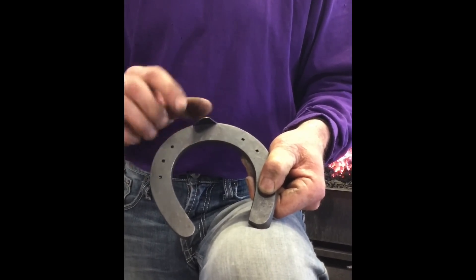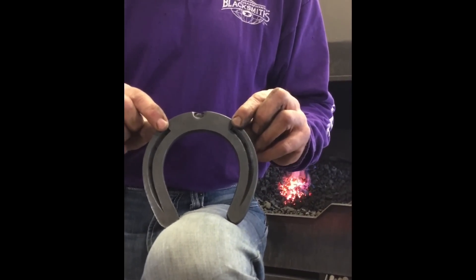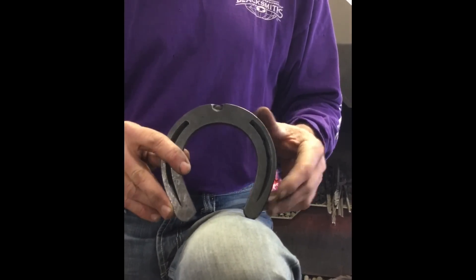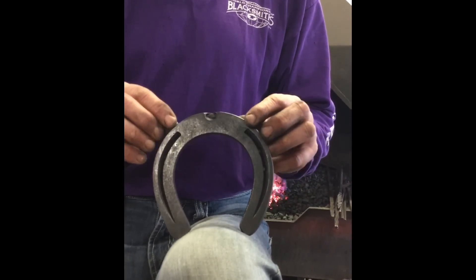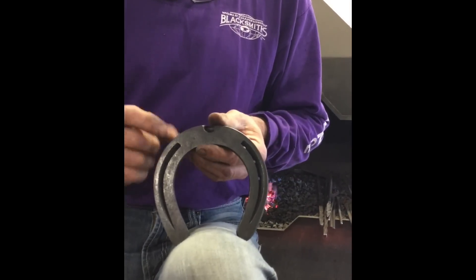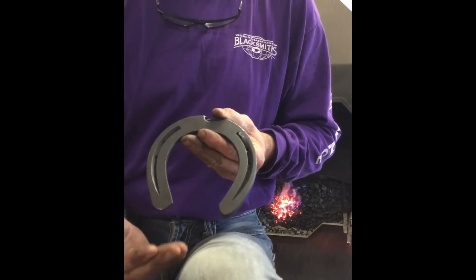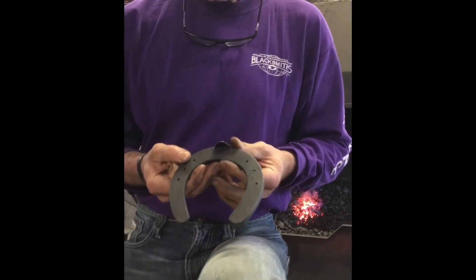If you don't have enough material in the toe, your toenails usually set up the breadth of stock for your toe. So in between your toenails, this is the amount of steel you have. A thirteen and a half inch foot is right on the bubble — if you don't bump it, it's going to look spindly and long. A mistake a lot of people just getting into shoemaking make is that as soon as you pinch up the stock, it accelerates in growth lengthwise. But as long as you keep a good breadth of stock, it doesn't grow as fast lengthwise.